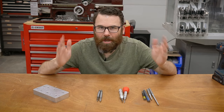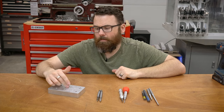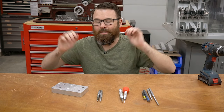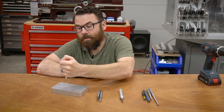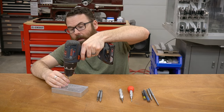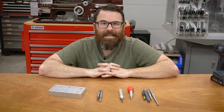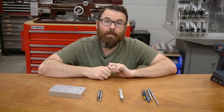So what is a center punch and why should you care? Let's say you have a piece of material that you're drilling into. This could be metal, it could be wood, it could be whatever. You've got your drill bit and it's just going to wander all over the place. Obviously that's an extreme example — you can drill straight holes without a center punch. But what a center punch does is it puts a little divot into your material so the drill can find its way in and it's not going to skate all along the surface. This is useful for pretty much any time you drill.